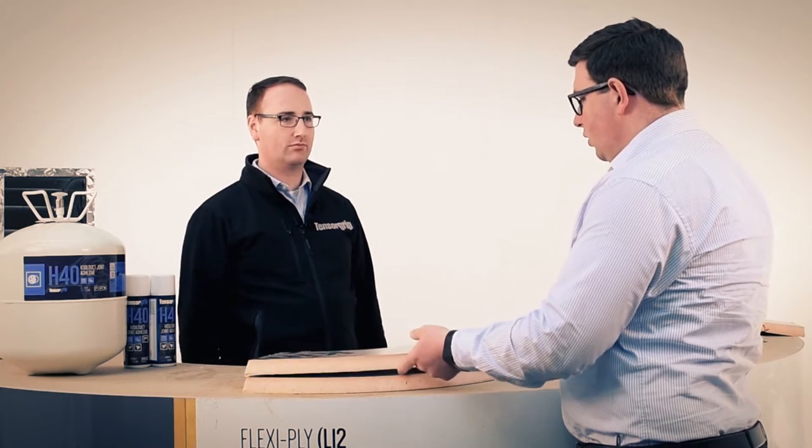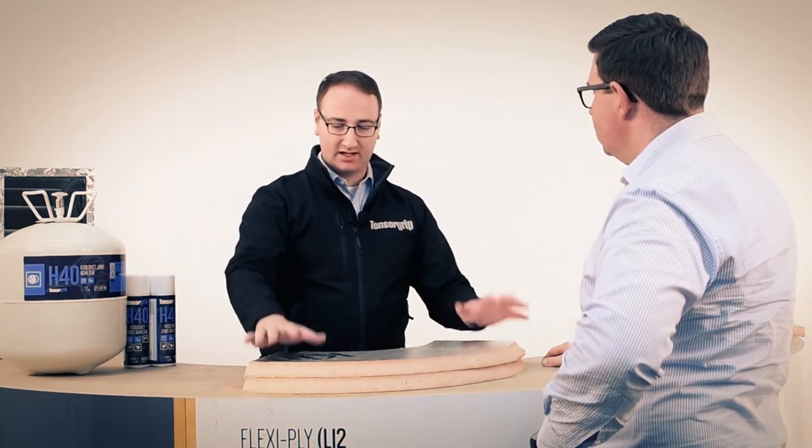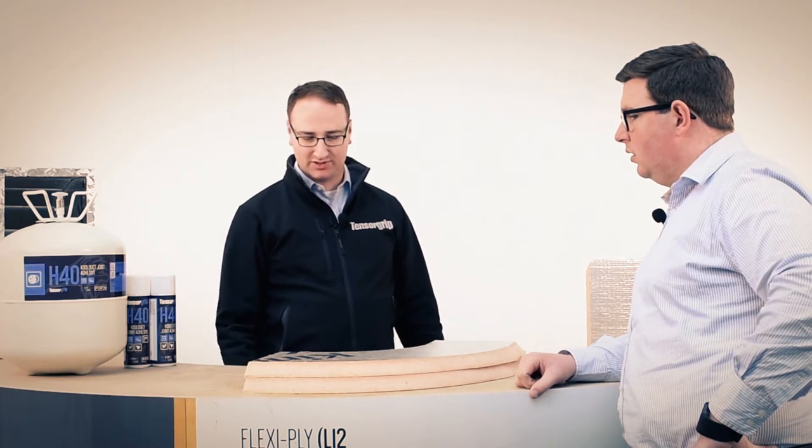Prior to doing this, you're going to be showing me a spray doing these joints. How were they doing this before? So traditional methods for bonding these V-grooves, if it's just a square or rectangular section, and also for the curves, the typical traditional application would be by brush, so you'd be brushing on adhesive. That seems to be what the trade guys are using, the Koolduct fabricators, the delivery partners as Kingspan call them. Okay, so this is what they've traditionally been using.